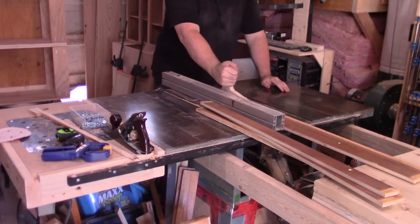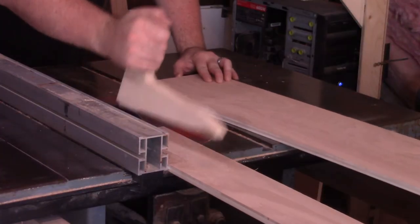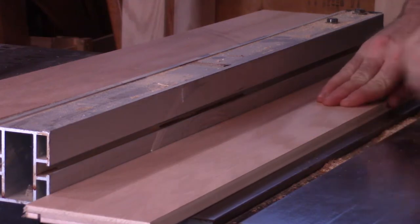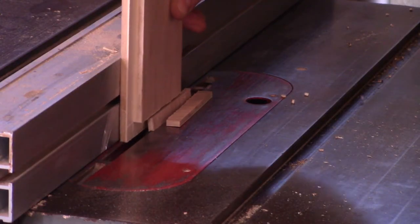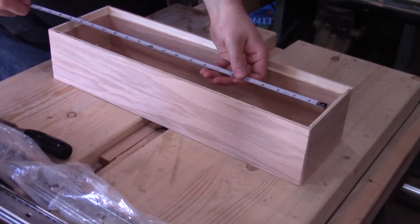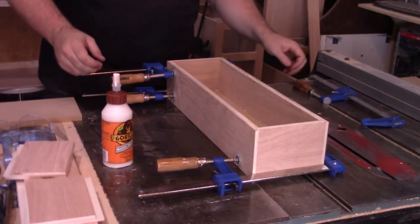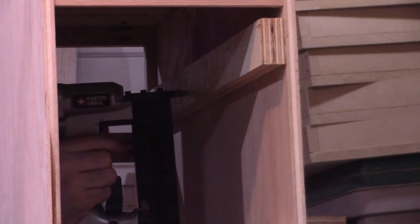With the cabinet now nearly built, I'm going to start on the drawers. Unfortunately, the face frame is in the way of the drawer slides, so I need to build out the drawer slide mounts. Using some of the salvaged material, I ripped scrap plywood into two inch thick strips and glued them together to get most of the thickness needed. With those drying, I moved on to building the drawers. I ripped some plywood into strips and cut a half inch deep rabbet off the bottom of the plywood. Then at the miter saw, I cut the pieces to length and headed back to the table saw with the crosscut sled to cut the rabbets out of the sides. With the drawer dry fit, I measured out the distance needed for the bottom panels, cut them to size, and it's time for assembly — a lot of glue and clamps later, I have two drawer boxes. I then cleaned up the sides of the drawer mount rails at the table saw, cut them to length at the miter saw, and glued and pin nailed them into place.